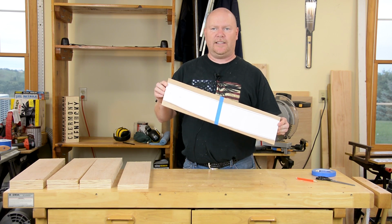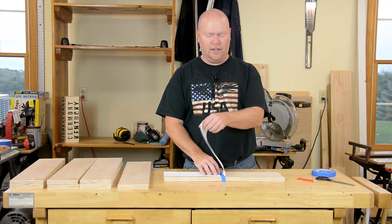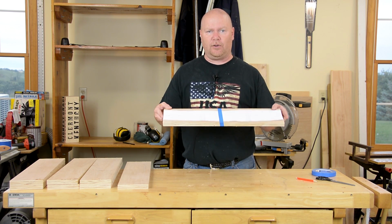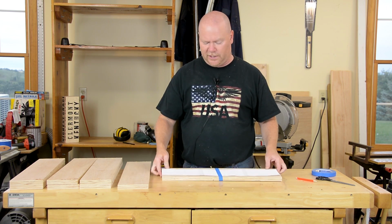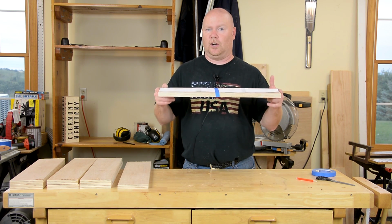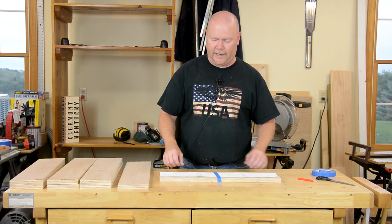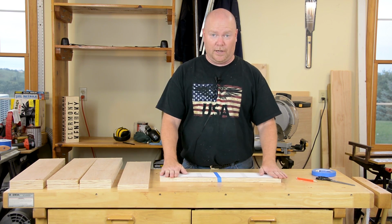I have my template blue taped this time in the middle, so I can come back and put my spray adhesive down and make sure that the template goes exactly where I want it to go. You would think it would be really critical to get these parallel edges of the template lined up with the parallel edges of the wood, but it turns out that it really isn't. What's critical is that these edges are parallel. If the template is cocked a degree or two, all it's gonna do is change the profile of your curves, and frankly, who cares? So let me skip a bit, brother, as they would say in the Monty Python movies,